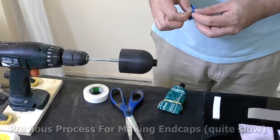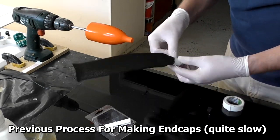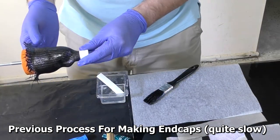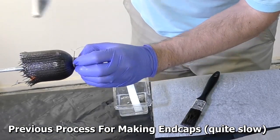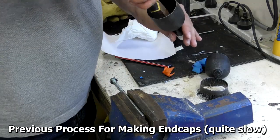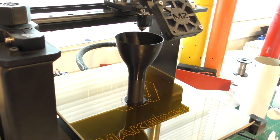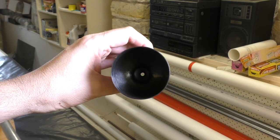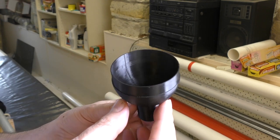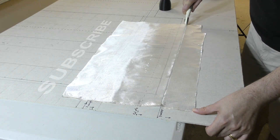Let's have a look at the end caps. Previously we would machine or 3D print a mould and use that to make the end cap from a carbon fibre sleeve, embedding a separately machined nozzle in one end and a separate piece of PVC pipe in the other — a process that typically took several days. In the new version we skip the mould step altogether and print the end cap directly from PLA, which saves a lot of time. Because this rocket uses lower pressures with only a 7mm nozzle, the forces are much smaller and the nozzle is just formed as part of the end cap. PLA by itself isn't strong enough to hold the pressure, so we need to reinforce it.